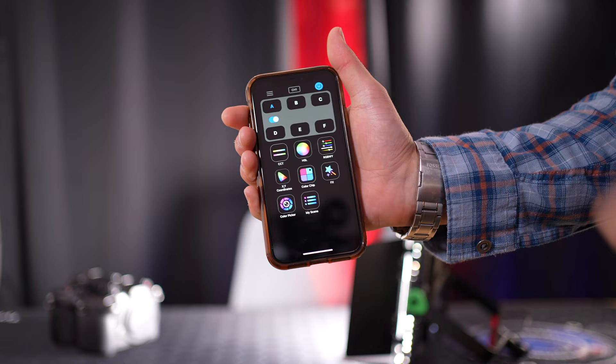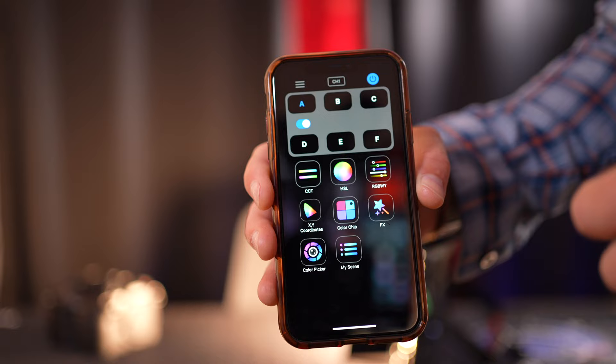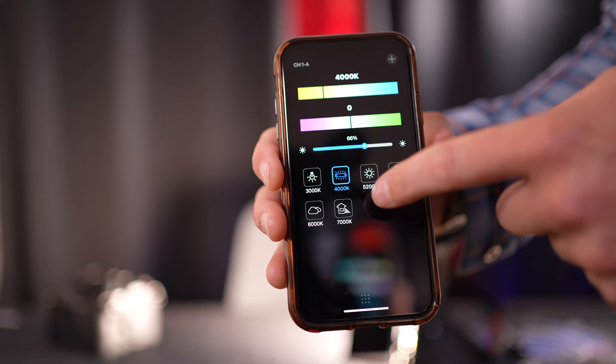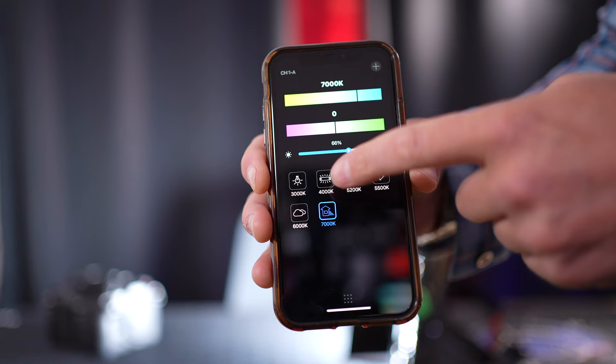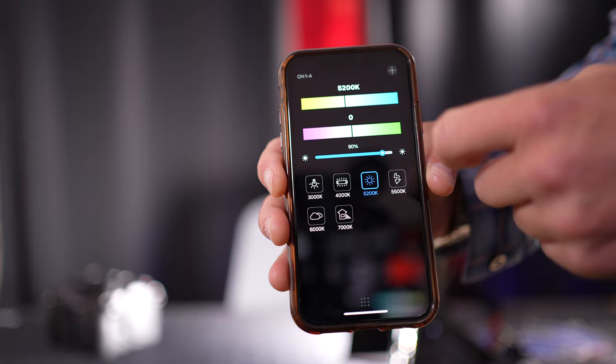The WP35 has seven main modes. CCT mode allows you to pick a color from a temperature range of 2,800 Kelvin, which is on the warm side, all the way through to 6,800 Kelvin, which is a cool blue light. I usually set my LED lights in the studio to 5,100 Kelvin and that works well for my studio situation. Anywhere from 5,000 to 5,600 is considered daylight and that will work great for most people getting started. Additionally, you can change the brightness from 0% in 1% increments all the way through to 100% brightness. This is a much faster process on the app than on the dials on the back of the light, but both work.